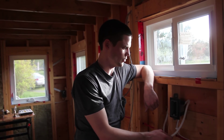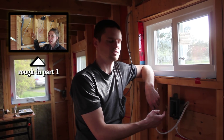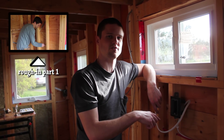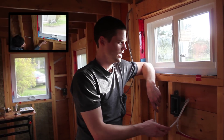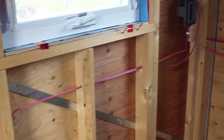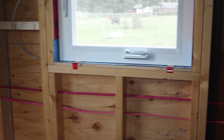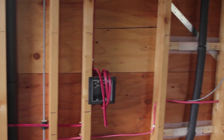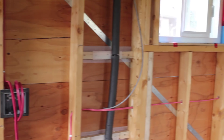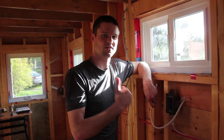This is part two of our electrical rough-in. We've got all the wiring roughed in, pulled to all the locations, made sure that everything is picked up on a circuit with the right wiring, and double-checked it. It's always good to make sure we're 100% before terminating or splicing anything, because if you've spliced and then need to add something later, you'll have to undo the splice — it just adds extra work. Doing all of one step and then moving on is always best.